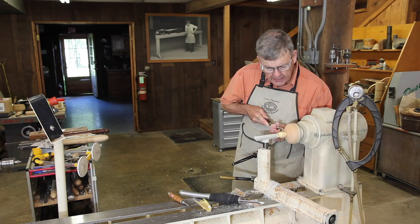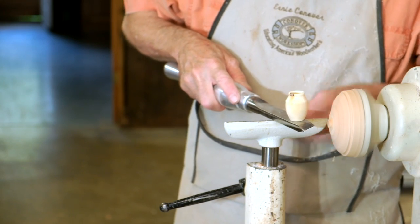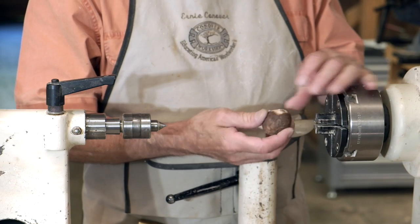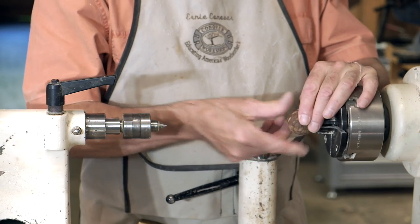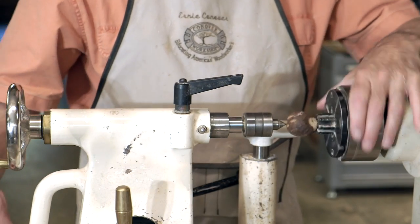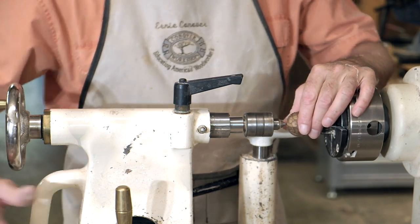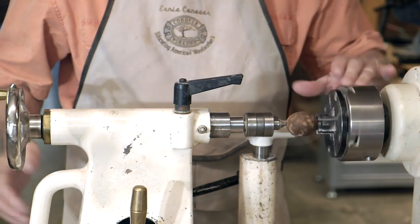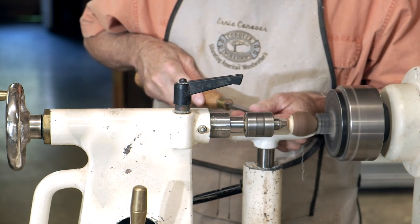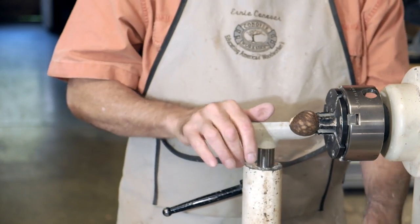We can now cut that off — we're going to do most of the cutting in the glue block. And there we have our finished piece. A second great way to chuck this is to find the attachment point and put that against a four-jaw chuck with a set of tower jaws, then play around until you find what you think is the best centering. I'm putting up a fair amount of tailstock pressure, then simply take a square nose scraper, scrape a nice little tenon, and grab that in a four-jaw chuck. We've got a very secure hold — we can do anything we want to it now.